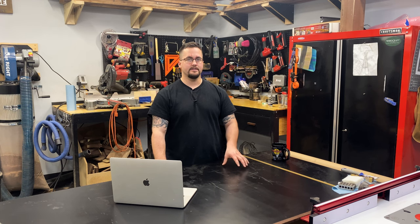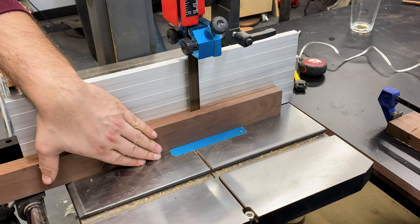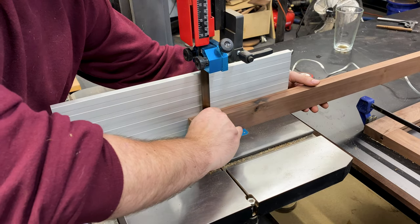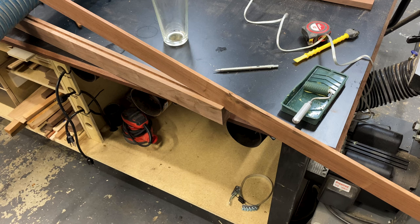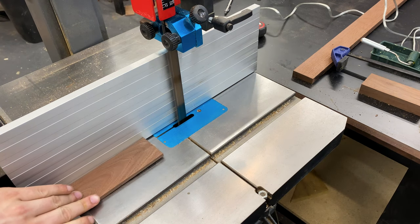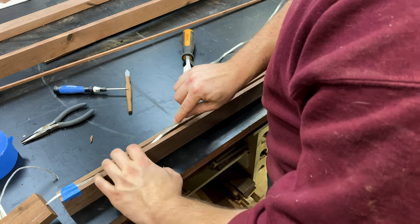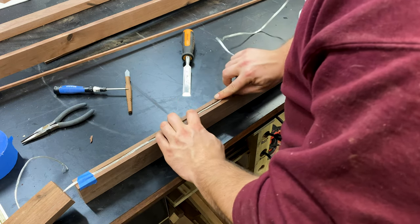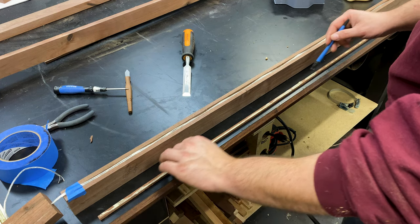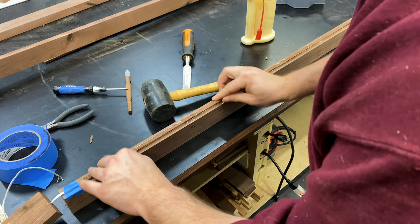After I had all my channels cut I needed to get started on filling the groove after laying the wire. I took a scrap piece of the two-inch material, cut just over a quarter inch out of it on the bandsaw, then took it to the planer and milled it down to a quarter inch, constantly checking for fit on the groove I cut inside of the leg. After I got it to the right fit I cut a thin strip off of my thin strip. I taped the wire in place leaving myself a lot of extra room to run through the post. After the wire was laid into the groove I applied glue to my thin strip, making sure to spread it around nice and even, placed the thin strip inside the groove, and then hammered it into place.